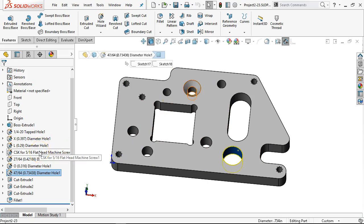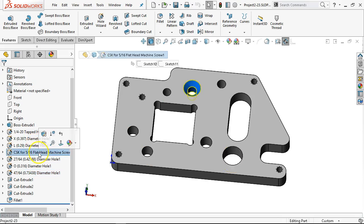Even the five-sixteenths — I'm pretty confident that I can take a quarter-inch end mill and have it open up for that hole size. Five-sixteenths through 0.323, 0.328 — in those values I think we can get pretty close and interpolate most of these holes after we peck through with the 201.